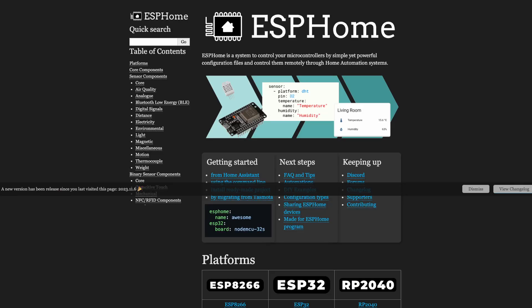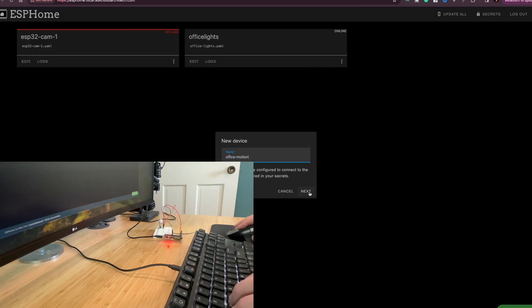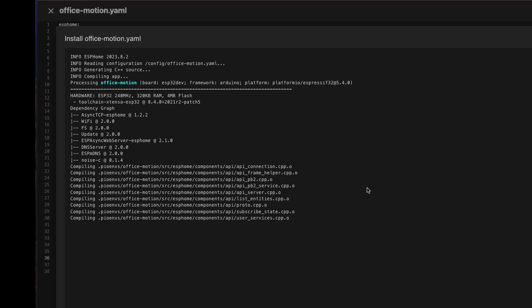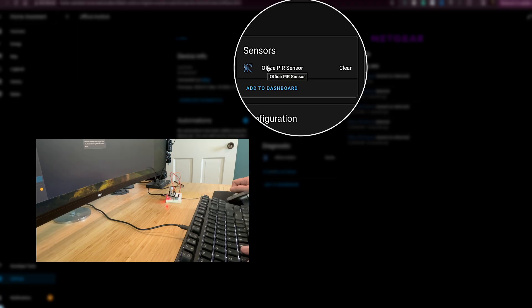To get this sensor to control my lights, I'm using Home Assistant with a program called ESPHome. ESPHome allows you to connect a ton of different types of accessories to an ESP32 and then instantly control or monitor them with Home Assistant. Getting ESPHome set up is pretty simple — all you really have to do is provide the configuration for the ESP32, then flash the chip with ESPHome. Make sure you press and hold the boot button on the ESP32 the first time you set up ESPHome so it can detect the board and complete the installation. I'll put the configuration file on GitHub and link it in the description. After setting up the hardware, the motion sensor appears in Home Assistant, and it's super easy to make an automation that'll turn on any number of lights when motion is detected.